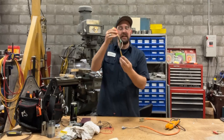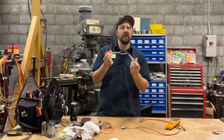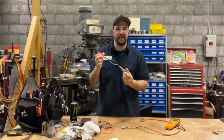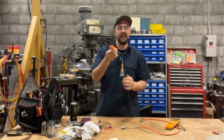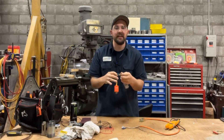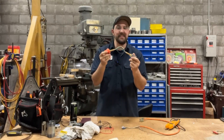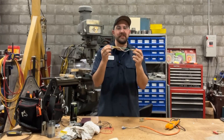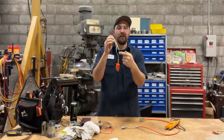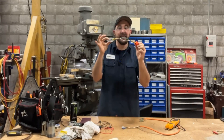Allow me to properly introduce Dan's Pro Shop usable amperage tester. It's just a chunk off of an old extension cord — I put an end on and exposed some of the conductors. It's that easy. You don't have to do any math like you do with the other one, and it just gives you a proper reading on all three lines. You can't beat this.